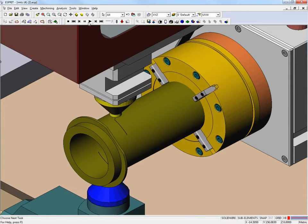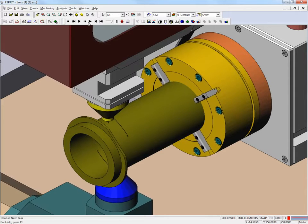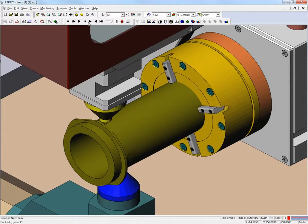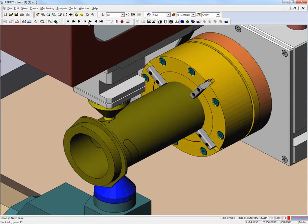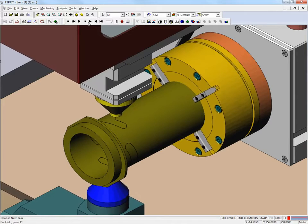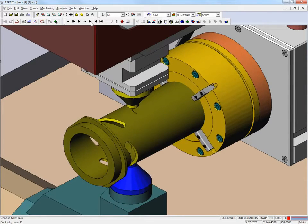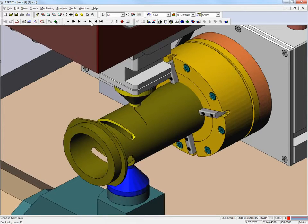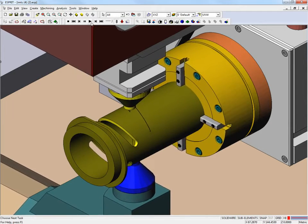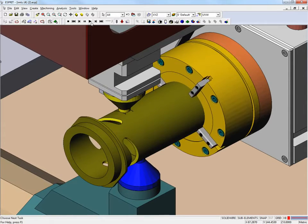With synchronized rotation, the workpiece is rotated during the burn. The turn-while-burn process synchronizes rotary motion of the part with X-Y-U-V movement of the wire. As viewed in this example, the rotation of the part is synchronized with the rectangular axis movement. Turn-while-burn greatly increases the flexibility and the complexity of the shapes that can be cut. This process is also useful for extreme tapers that cannot be cut with traditional wire EDM.